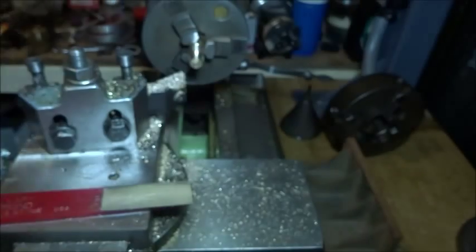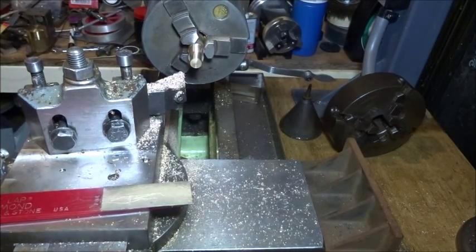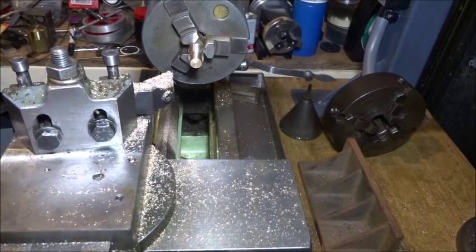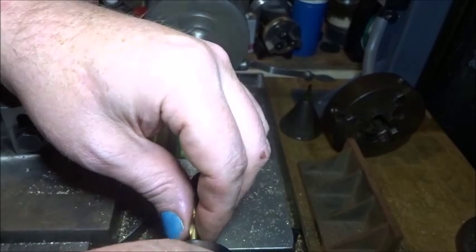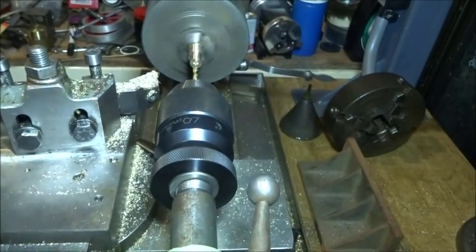This bearing in the drawing is only 18mm long, which isn't particularly long. I'm going to go with 20mm — I think that won't hurt. I'm going to put a standard drill in there next. This one's a nice, neat, sharp 4mm drill, not too much of a bend or anything in it, so we'll do that next.